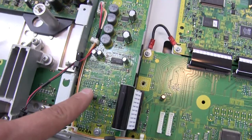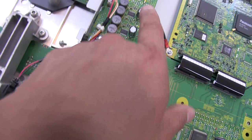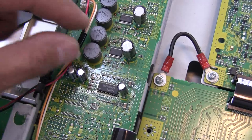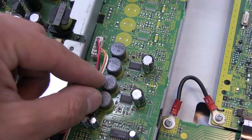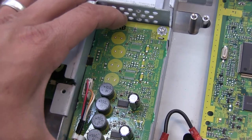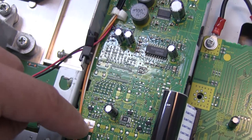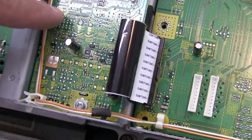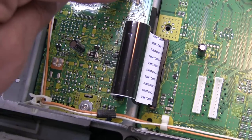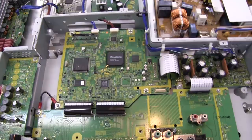There's the audio amplifier with this big connector, but obviously not everything will be used if the other amplifiers aren't populated. It looks like each chip here is an individual amplifier — each one would use two inductors going to one speaker. This whole board was meant for a four-channel solution with stuff not populated for the other two channels. There's a chip marked M5243AFP09 — maybe something like digital volume, treble, and bass adjustment.